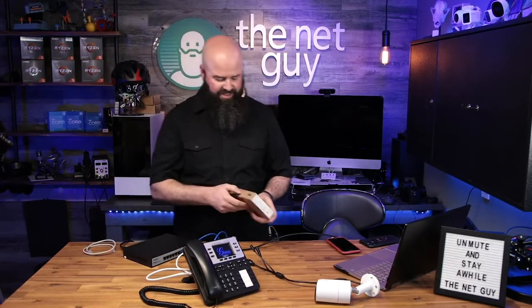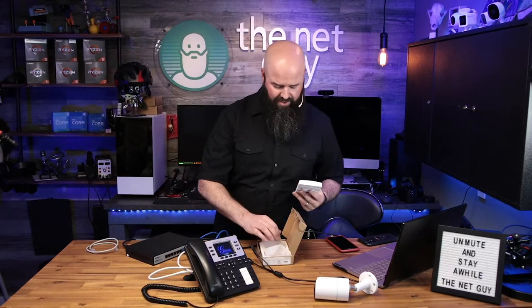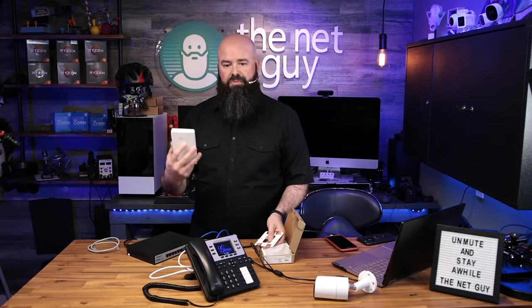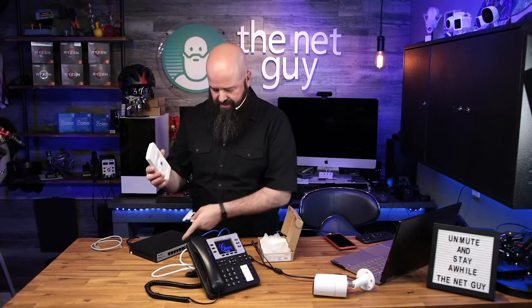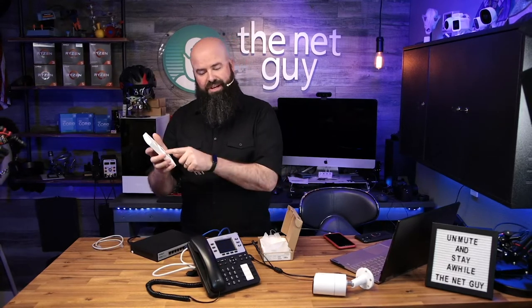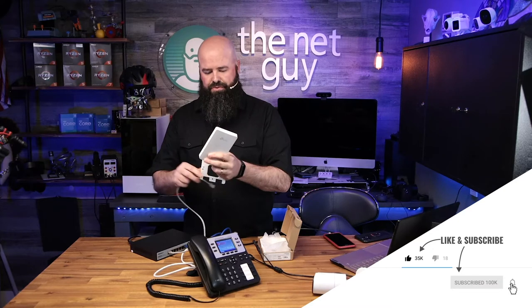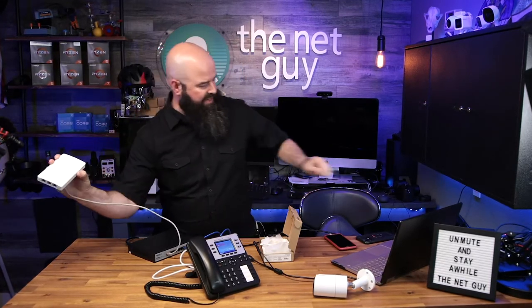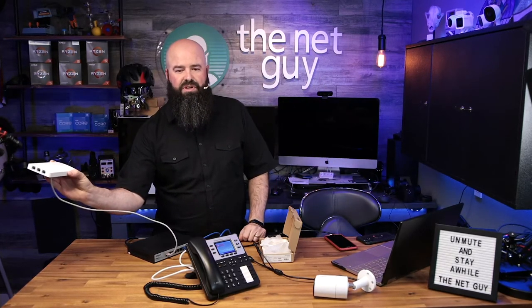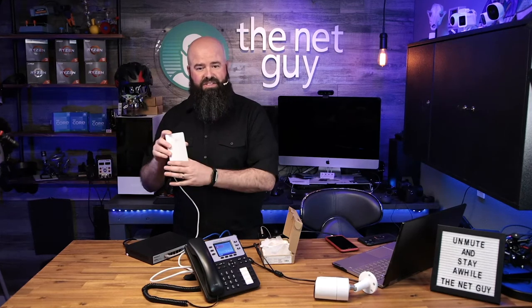The third device is really cool for occupancy use cases - this is from TP-Link, their in-wall unit. I've seen these in the wild, and the Aruba ones too. It's designed for hotels, schools, and similar environments. It comes as a wall plate for a standard outlet, and you wire one incoming PoE ethernet cable to it. It's a downstream switch situation, and it comes with three extra ports - one with PoE output for a phone - and it's an access point itself.